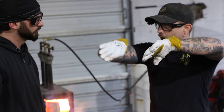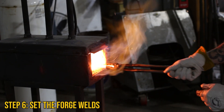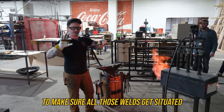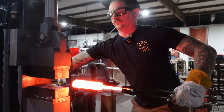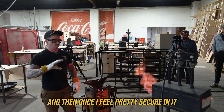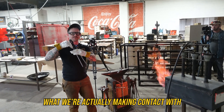You want it dead flat — set the weld, then get to beating. That first set is so important to get all those welds situated. After that they'll be able to stretch the billet out to about 24 inches. Duncan rotates it every pass to ensure everything is level and even, then once he feels secure he takes a bite out of the front and slowly squishes it all the way down, isolating the pressure so there's more impact on the area they're actually working.